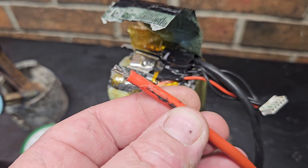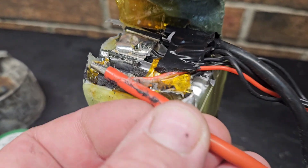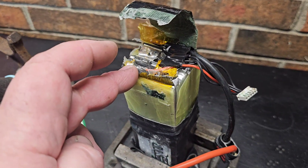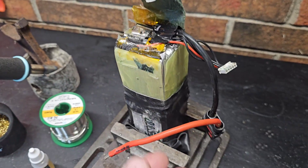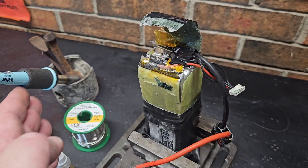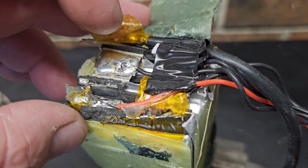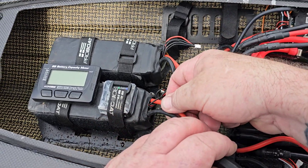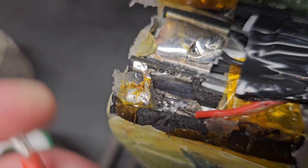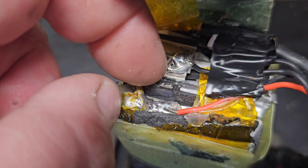This battery is about two years old. It's been completely submerged in brackish water about a year ago, and I'm starting to see the effects of the LiPo being submerged in salt water a year later. I've already had to re-solder balance leads back on, and today while running the twin Arian, it looks like we melted the stock solder — you see this little bead of solder that melted. We need to cut that off because it looks like it's about to hit another tab on the battery pack. Good thing they put that foam in there.